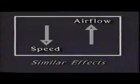The airflow and eccentric speed are related to each other. That is, similar effects can be obtained by increasing airflow or decreasing eccentric speed. What is important is to find the right combination. We mentioned earlier there are upper limits and lower limits to these adjustments and how to recognize them. Within these limits, a number of combinations will produce satisfactory separation.